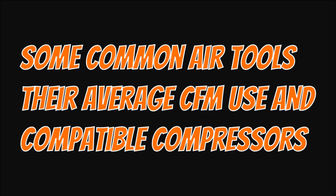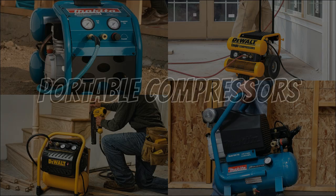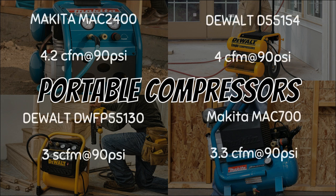Now let's take a quick look at some common air tools, their average CFM and compatible compressors. Shown here is the average CFM of some common air tools often used with small portable compressors. These type of portable compressors are best described as being able to be carried by one person. Most compressors shown here are oil filled and only 2 would adequately run the 3/8 ratchet.